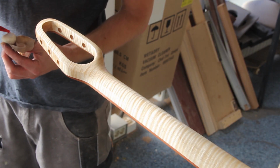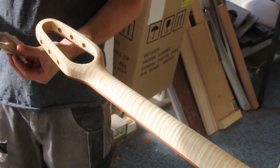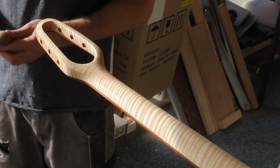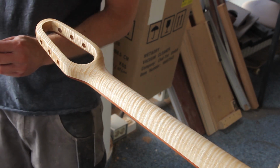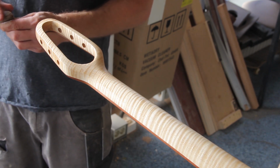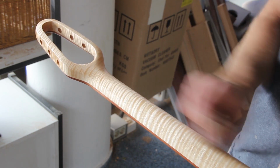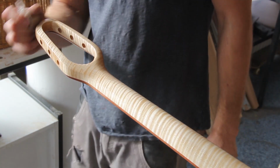I'm going to go for the pore filling, so some shellac on the pad, and see that the shellac is coming through, so you feel it, it's wet. I like a little bit of pumice and a drop of oil, and kind of work it in. And then really light pressure, so we don't have a big chunk of pumice anywhere sticking.